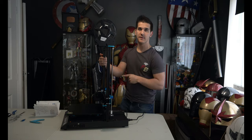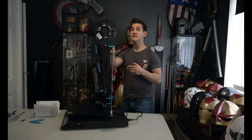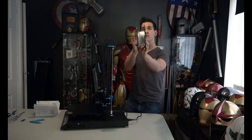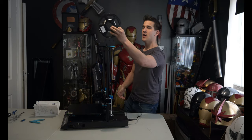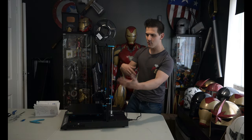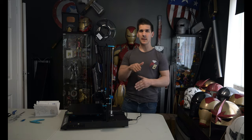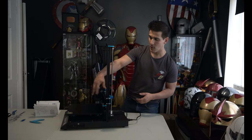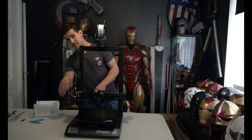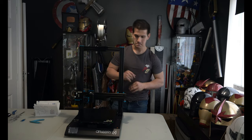Installing the filament holder — this is also a very unique filament holder. Never dealt with a bearing system like this. Make sure you put it inside the belts — don't pinch the belts onto the frame. I'm not the biggest fan of the way the filament holder sits on top with the bearings because if you have a roll of filament that's wider or narrower, like Amazon Basics is like twice as wide as this, you're going to need to loosen it every time. But if you're using the same filament all the time, the same brand over and over, that won't be a problem at all. It uses ribbon cables — there's a name for these flat ribbons, you typically see them inside electronics for LCD screens and stuff. Be careful when installing them. You're going to have to plug one into your extruder system right here — it plugs into the side, it's taped to the side rail. And then there's one taped down here that plugs into the actual base of the printer. The way it moves and folds in with the printer as it moves — I'm a fan of that.